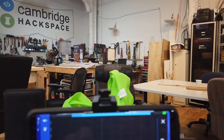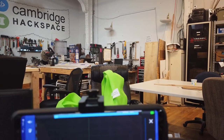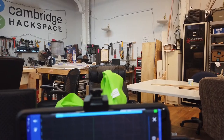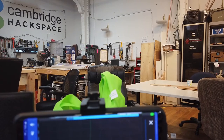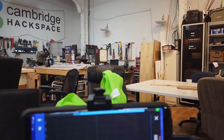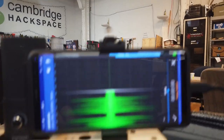So you can hear my voice. I'm talking right here. I'm going to bring it up to 12 and I'm still talking. And it looks like I'm clipping a little bit. If I bring it up all the way, you can definitely see I'm clipping quite a bit. Bring it down to 12, and I don't really think, just a teeny bit, so maybe 11 o'clock. So 11 o'clock looks like it's going to be the best for me.